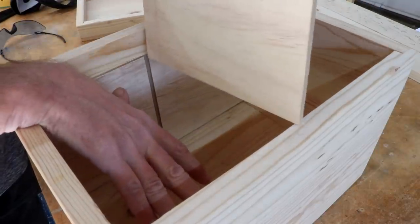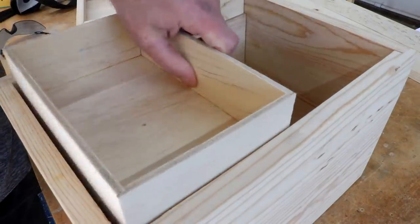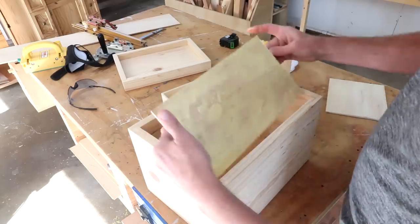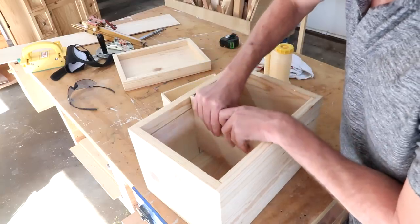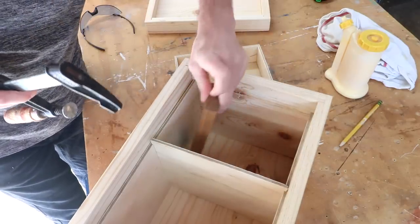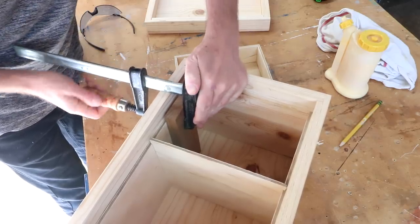This is the piece I cut to size and it's just going to fit down in those slots like that. There's a slight lip so that the tray won't slide around. I'll just glue these pieces into place. I can use this divider as a clamp to help provide pressure, but I'm still going to need a clamp on this side. I can use a scrap of wood to help spread the pressure across from top to bottom.